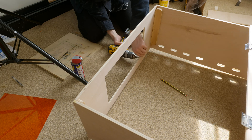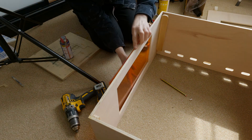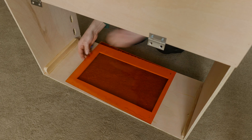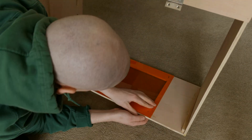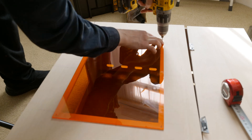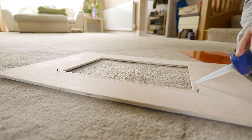I'm putting in a few small hinges for the lid. Then I'm making the holes for the acrylic panel and mounting it onto the back, using clear silicone to seal it against the wood and M3 bolts to secure it in place. I do the same for the top lid, with silicone around the edge to seal it.